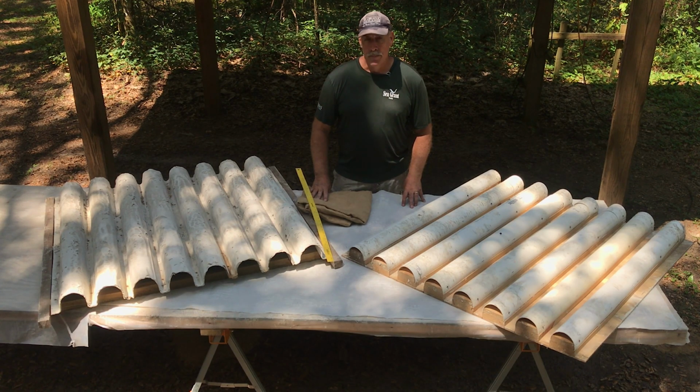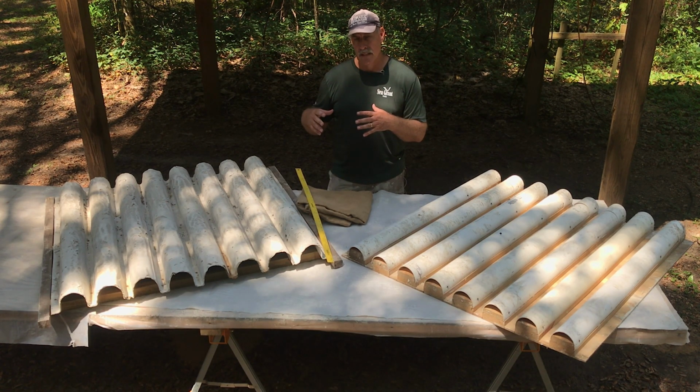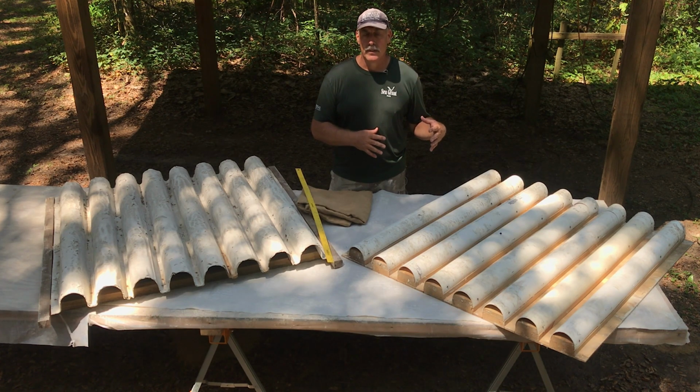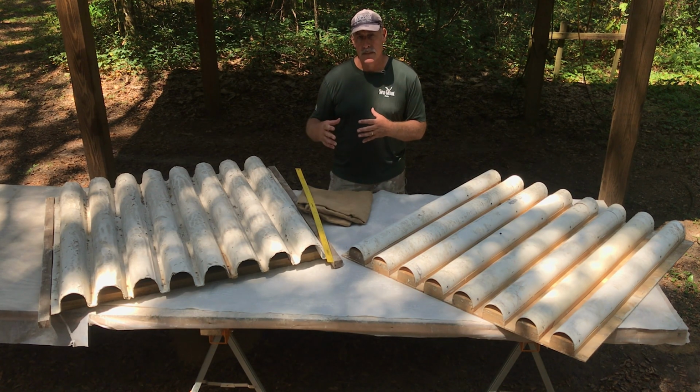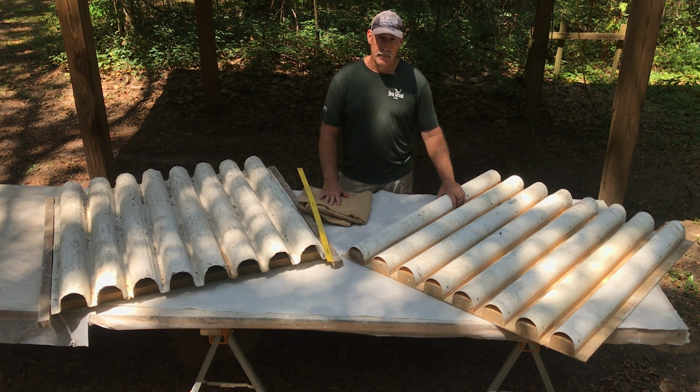We're talking about panels, and so the way the JRCSA material works is after you've immersed it in the CSA material, then you have to have a form to lay it over, and we've shown you how to build prisms and the form associated with that. Now we have to show you how to build a form for the panels.